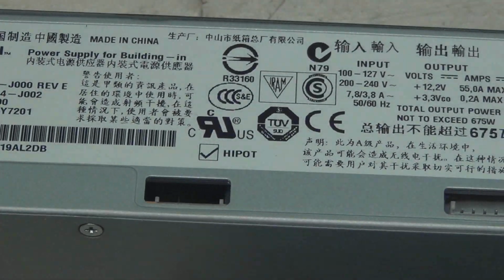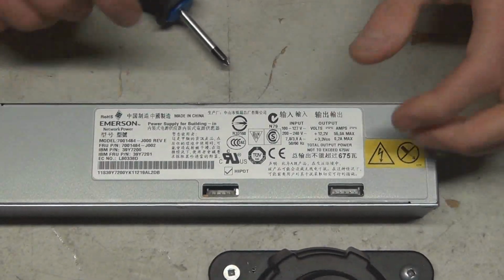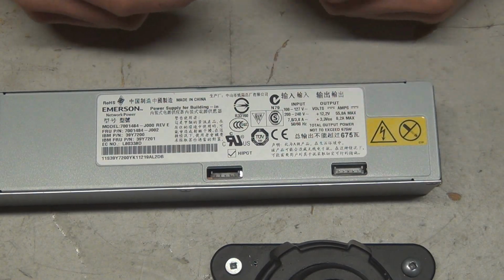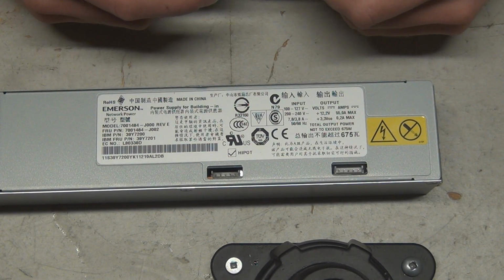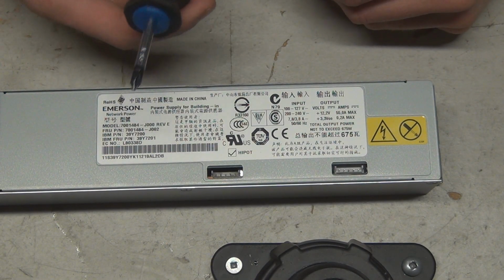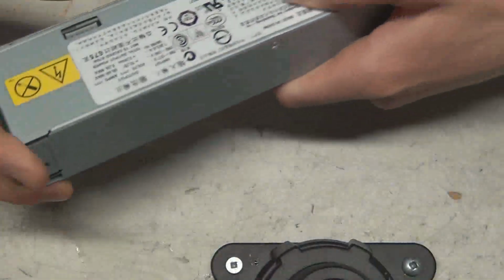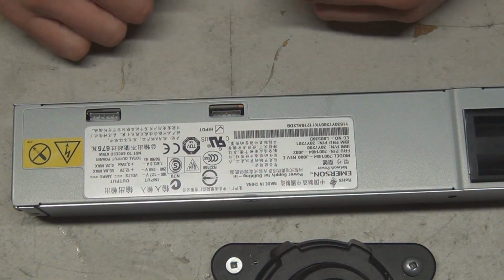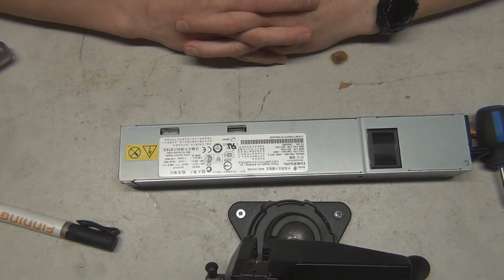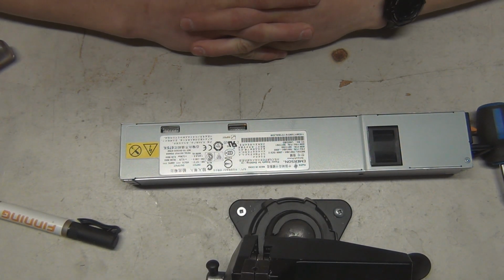Good product power supplies, or good company power supplies, good brands should be made properly. So the big capacitors will have bleed down resistors in them a lot of the time, especially the high voltage ones. And if they don't, the circuit itself naturally bleeds down over time. If you really aren't sure, just take a screwdriver or anything and short it out. Worst case, you'll blow the leg right off the capacitor, but nothing a little bit of solder can't fix.